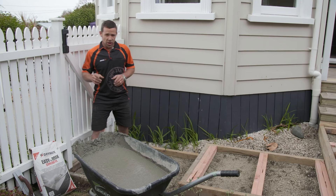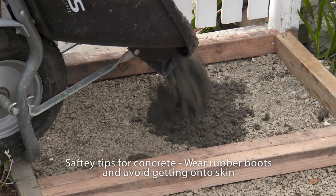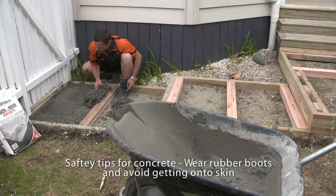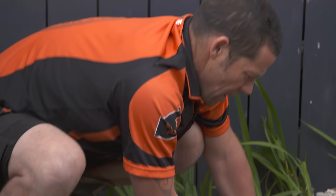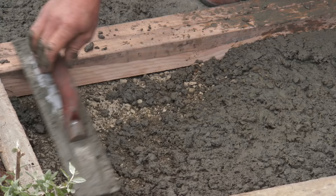A little tip: I'm going to add half the stock standard concrete into the pavers first, then put the mesh in, and top it up with the colored concrete. Two reasons for that — one, I'm going to save money on the black oxide, and two, I'm going to get more color consistency across more pavers with one mix in the barrel.